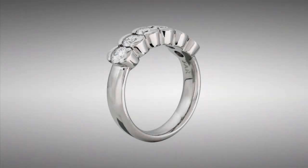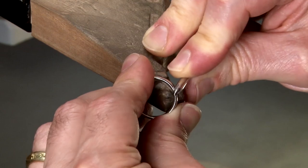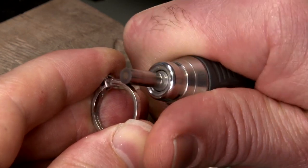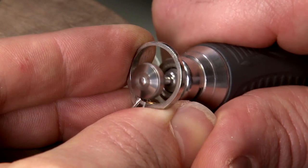This video micro topic demonstrates a method for burnishing platinum jewelry to remove gouges and scratches. Burnishing pushes metal back to its original location before polishing and finishing. It's better for the value of the piece as well as the engineering integrity to retain as much metal as possible.